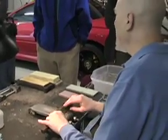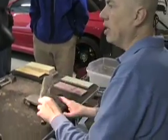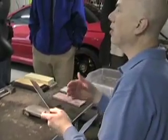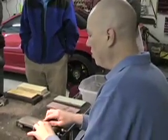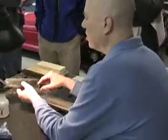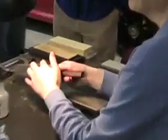Most people, when you first start, put the magic marker on there, and then they go from there. I was going to show you guys the magic marker thing, but instead let's talk a little bit more about an advanced way of finding it. Really what it comes down to is you have a couple of bevels here. You have your iron bevel, which is the cladding, the gray part here. Well, I guess it's all kind of gray now because there's a patina on the edge. And then you have the steel, which is the part that shines up.